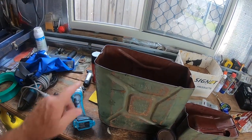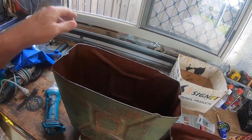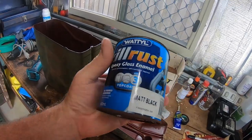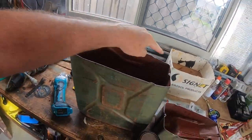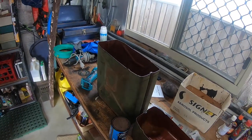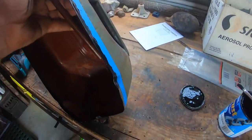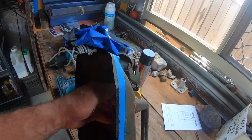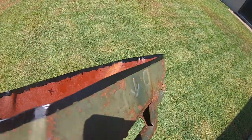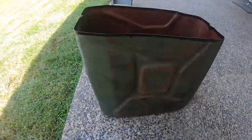Now that I've got the jerry can all cut up, I want to try and retard some of the potential rust that may occur around the cut. I've got some of this Kill Rust matte black and I'm just going to treat the edges both inside and out, both top and bottom. I've taped up the outside, painted the inside and the top edge, and now I'm going around the outside. Once I finish that I'll pull the tape off. Let them dry - give them a couple of hours, probably should leave them a day to dry properly.